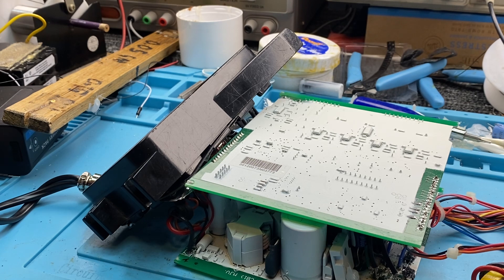On a DD coil you don't actually need that transistor switching — you can direct-feed into the detector with just some 100mA protection diodes for any leakage. That approach gives a lot more signal. You do need the switching for a mono coil because the transmit coil is also the receive coil and you've got that nasty flyback voltage — you can't feed that straight into your op-amps. But on a double-D or concentric coil you can get rid of the switching receive FETs and direct-connect. That should be fairly obvious to people who've thought about it.